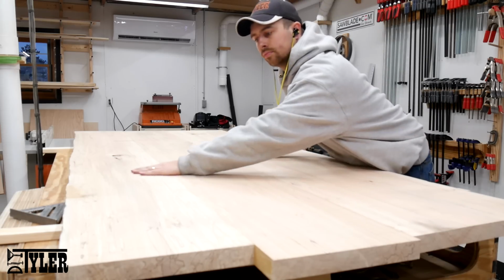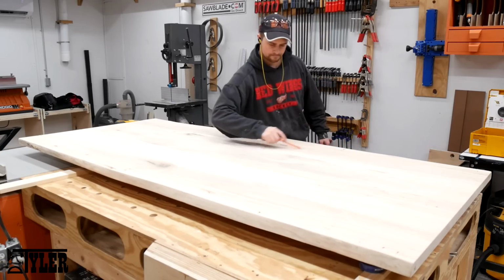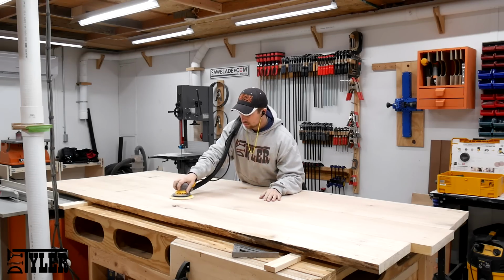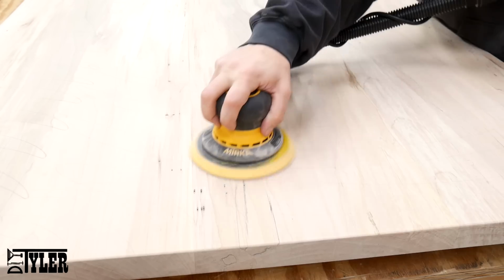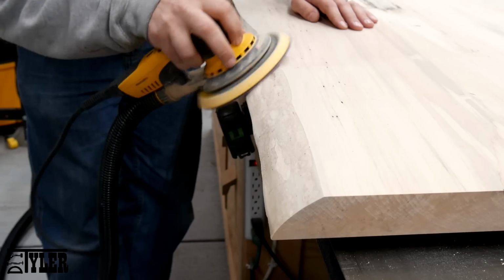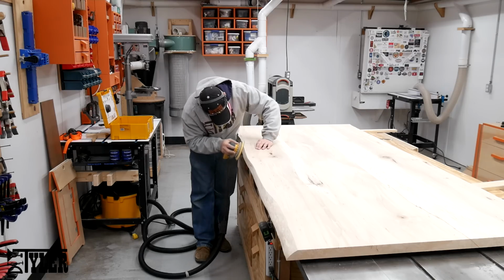I used a chisel to clean out the glue squeeze out, and then 1 heavy pass with 60 grit sandpaper, and then marked some lines with the pencil technique so that I could tell where I was sanding. Worked my way up to 180 grit with the random orbit sander, making sure that I took the time to hit those live edge sides.